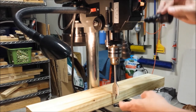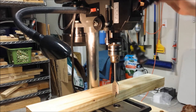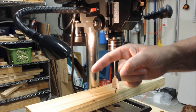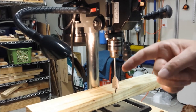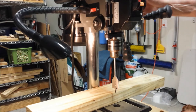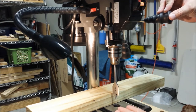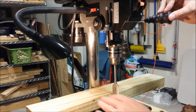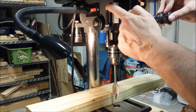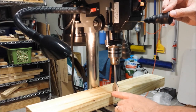You can use this to figure out how far into the wood it's going. I always keep an awful lot of scrap wood around, so I do an awful lot of test drilling. When I was doing that other piece of wood, I probably drilled eight or ten practice holes on a piece of lumber the same size before I actually started drilling, just to make sure I got it the way I wanted. You do have a gauge up here. If you know that this plate is always at one location and you know where the workpiece is, you can remember where this gauge is — or even mark it with a marker — and always set it to that depth. But the way I do it is just like I showed you each time.